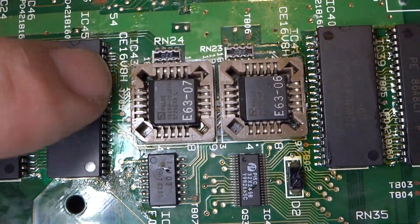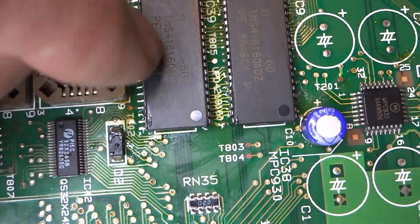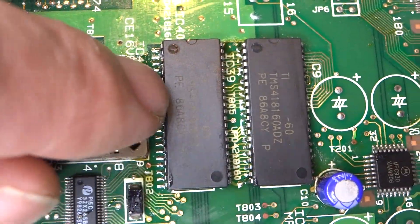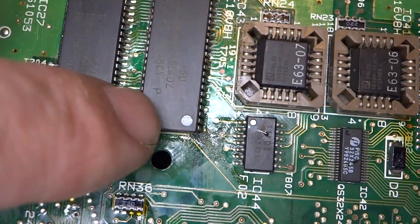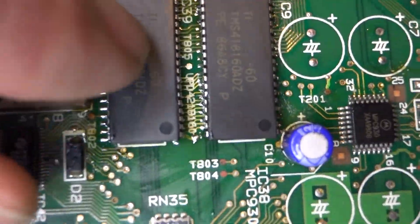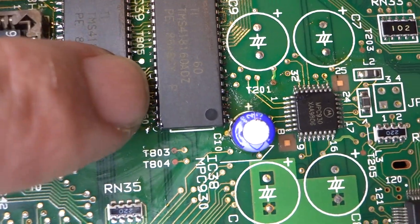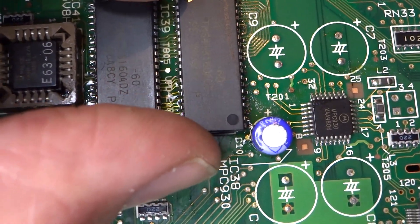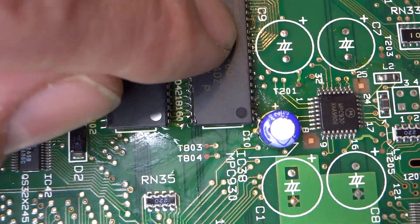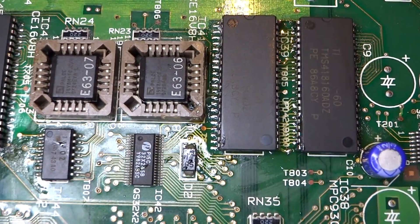It's really hard to get soldered in there. What I did is I tried to pull this back as far as I could and used my soldering pen to get in there, using drag soldering to get these pins. You have to be very careful when you remove these chips - too much heat and you'll get blistering and bumps that can destroy the board, and if you try to clip it out you can wind up breaking the traces. What I did is I soldered a wire all the way along the bottom, clipped the tops one by one, soldered a wire on the other side, and once I got the first set broken free I rocked it back and forth. Then using soldering wick, I just rolled across it and scooped up all the legs. Worked like a charm.